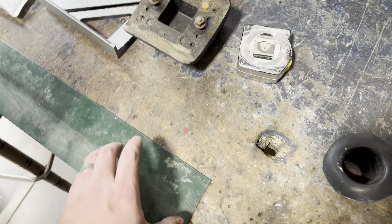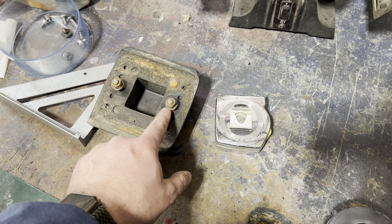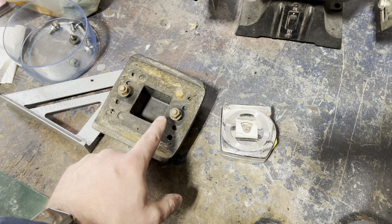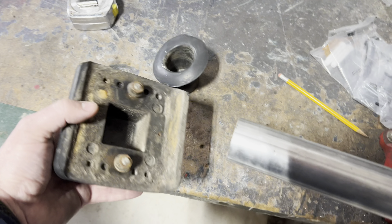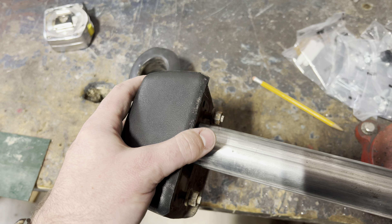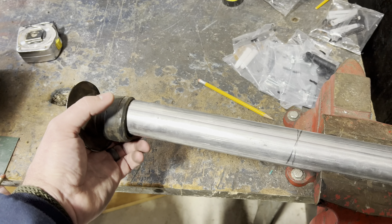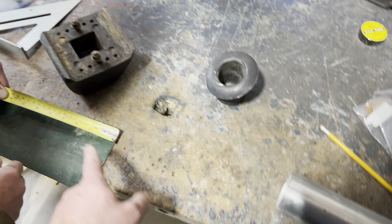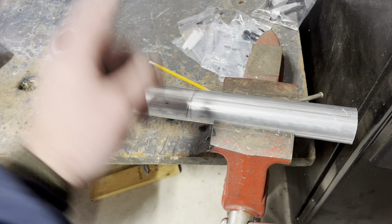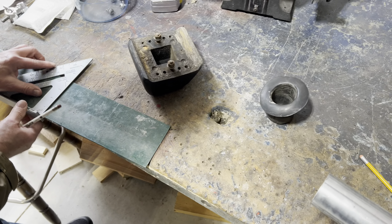Marking a line on there so we can cut this, drill some holes, set it on here, and then we're actually going to weld it around the studs and then cut the studs off so it's completely flat on the back. Then with the welded plate on here we'll be able to stick this exactly where we need it, welded to that pipe, and this will slide in and hold by tension — it gets really tight inside and outside of that diameter. These are about 20 bucks, a lot better than $400. The pipe is scrap steel from a muffler shop — 10 bucks. Pretty cheap and I think it's going to look pretty good.